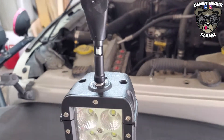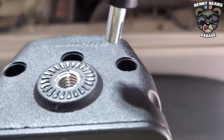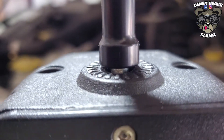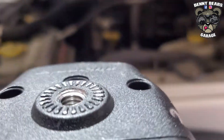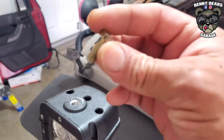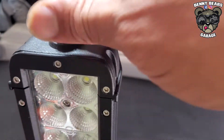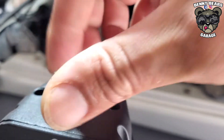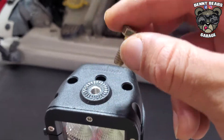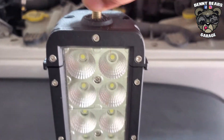Use the same handle you used to tap, and insert it all the way in there — make sure it's past the flush, just enough, or until it stops. The further in the better. There you have it — that's a press-in insert and you have fresh threads for your bolts. In this case the 5/16 by 18. The deeper you go, the tighter it gets. If you don't have the depth to re-tap and need more threads, this is the way to go — it gives you a whole bore full of threads.